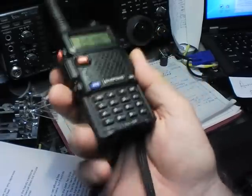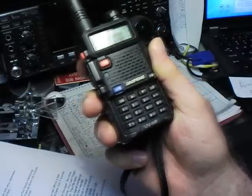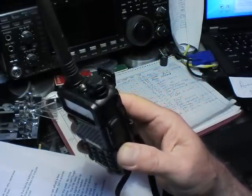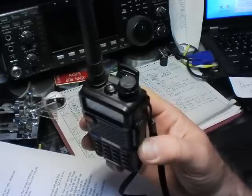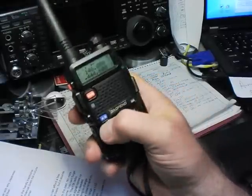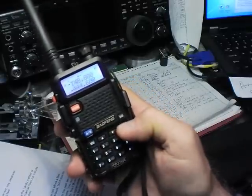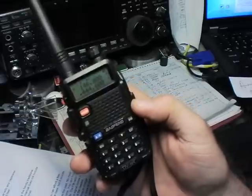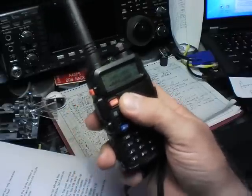Another feature: the TX audio is very clean. It's fully deviated and the frequency was pretty much spot on the frequency counter — as close as I've ever seen radios out of the box. The radio is already cut and transmits over most of its receive range. The only place I didn't see it transmit was the very bottom, right around 400 MHz, but after 410 it started generating power. The China Girl announcer inside is sort of cool — hit the buttons and it tells you what's going on, especially on menu items. The multicolored LED lets you choose separate colors for RX, TX, or just when you're pressing buttons — orange, blue, and purple — they really look nice.